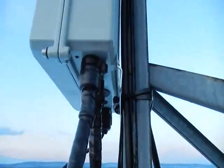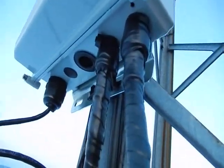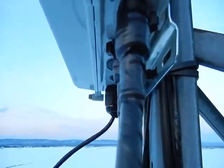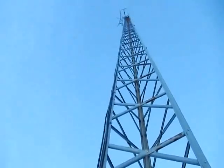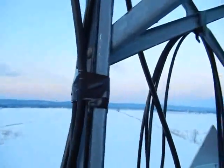Okay, so here we are about 20 feet off the bottom of the tower. I've installed my access box over here at this level, so there are the two coaxes coming in, all properly sealed with the rubber tape, and then electrical tape on top of that to protect it from the UV. If we look at the top — let me see if I can zoom in — there we go. So I just need to run the Cat5, which is right there, actually coiled up right over here. Just need to run that to the house, plug it into the power injector, and we're done.